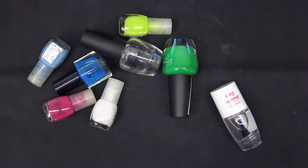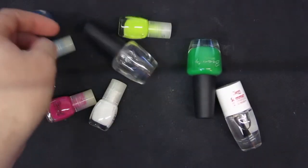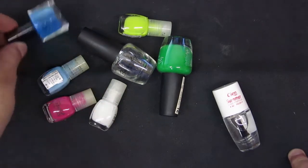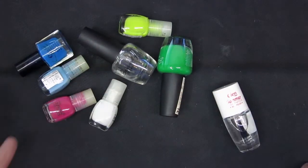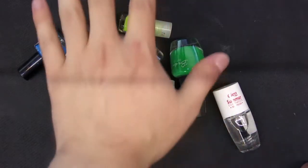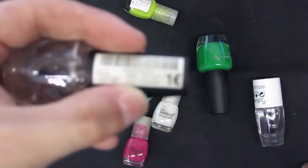Welcome. Some of us may have been using nail varnish as conformal coating for electronic boards, and that's what I've been using for quite some time actually. I started with this stuff, and it has been doing the job very well, as it doesn't dry up like the others do, because it remains somewhat soft and rubbery even after it dries. I later noticed that all the others that I have are not like that. I just buy the cheap stuff, like this is 1 euro